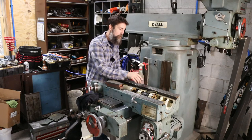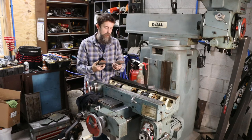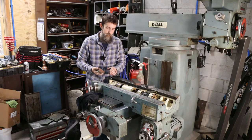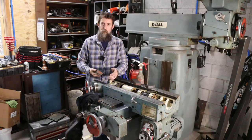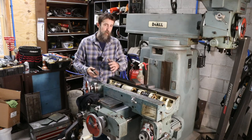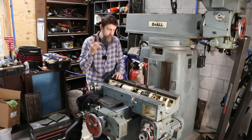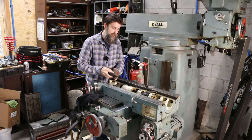These stones are not like your standard bench stone. These are ground flat on a surface grinder. They're so flat, if they're done correctly, that all they do is take off any of the high spots or imperfections in a nice flat surface, and they basically glide over all of the non-damaged surface. So if you want to deburr the bottom of a rotary table or a square or any tools that you're going to put on the surface grinder, deburr your magnetic chuck with these without damaging the chuck. Super handy, and I can't believe that I didn't know that these existed.